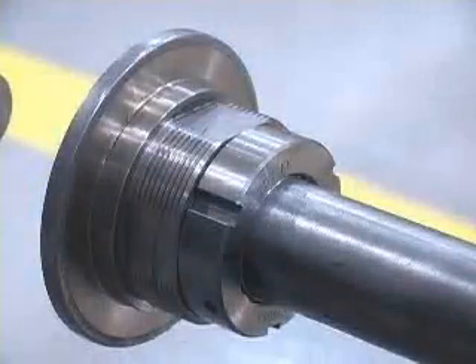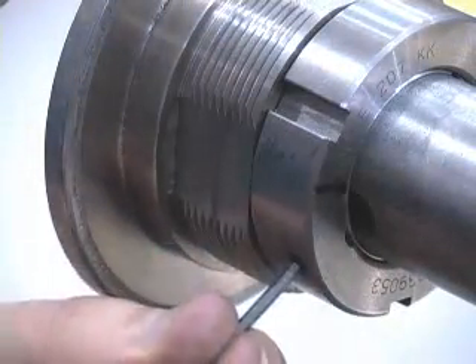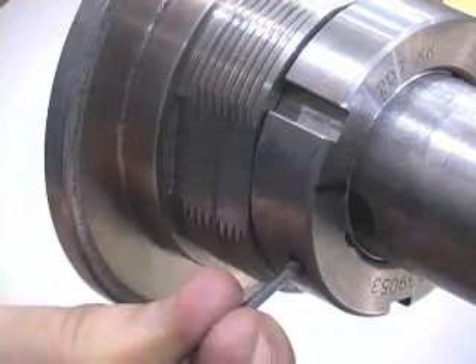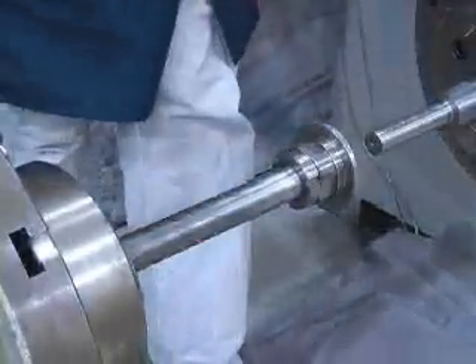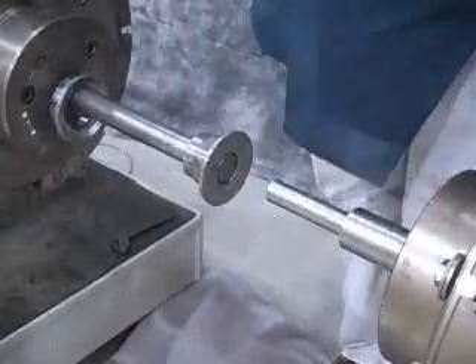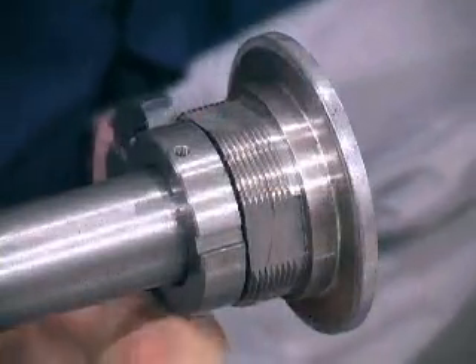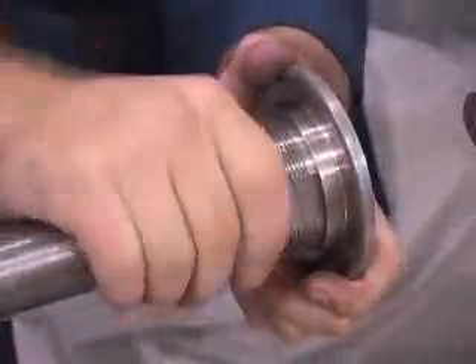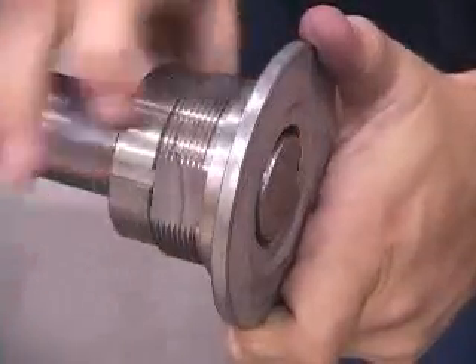Now let's take a quick look at how to remove the grip tight flange. To remove the grip tight flange, start by completely removing the set screw from the adapter lock nut. Rotate the lock nut counter-clockwise until it becomes snug. Once this occurs, strike the backside of the flange with a soft mallet or dead blow hammer around the entire face. The threads should alternate between coming loose and tight as the lock nut is turned. Do not drive the lock nut when the threads become tight. Strike the back face of the flange until the threads come loose before continuing to turn the lock nut. Repeat this until the flange assembly comes loose from the shaft.